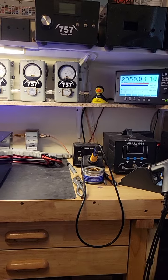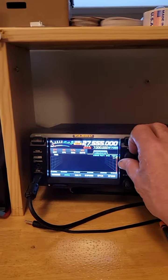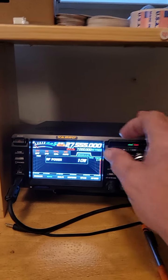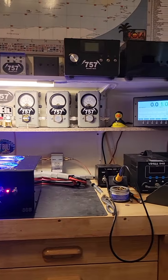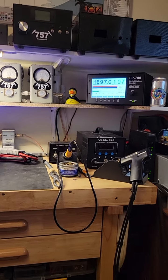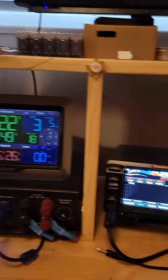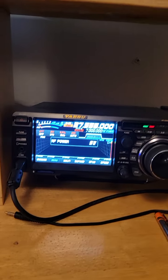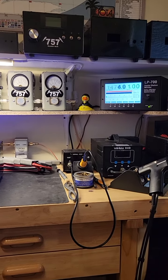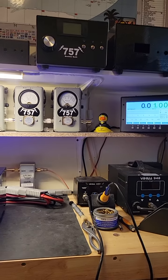Audio test, 1, 2. That's if you really want to run it hard. I would recommend actually running this one right at 10 watts — that's if DX is really rolling and you want to cut through. You're doing a good solid 1800 watts. If you just want to be conservative, as I would recommend, and it'll last forever, at 5 watts you've got your 1500.